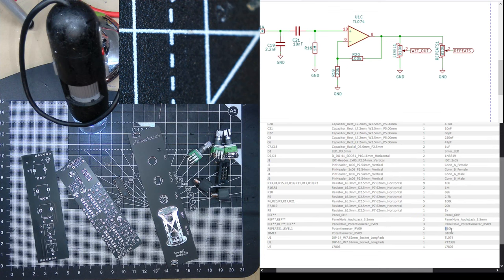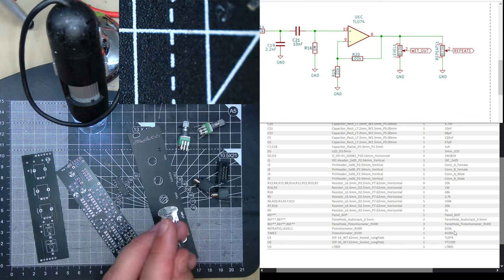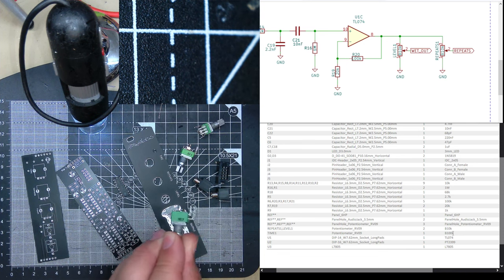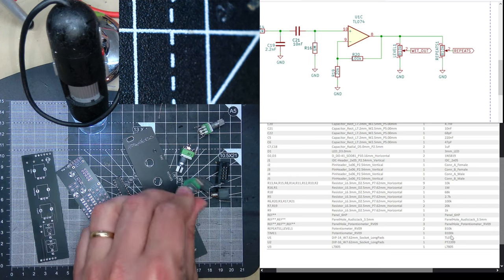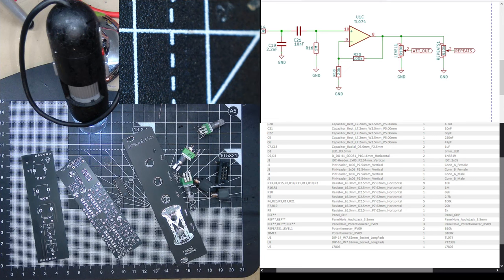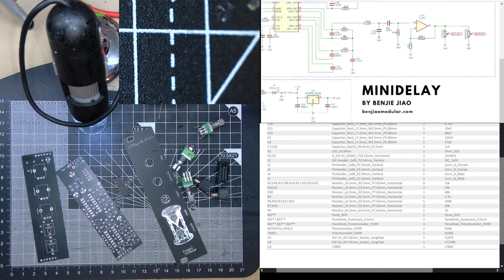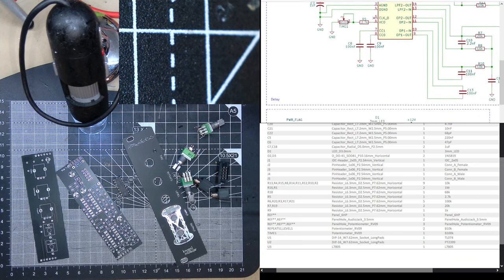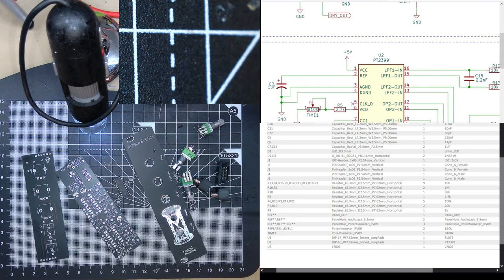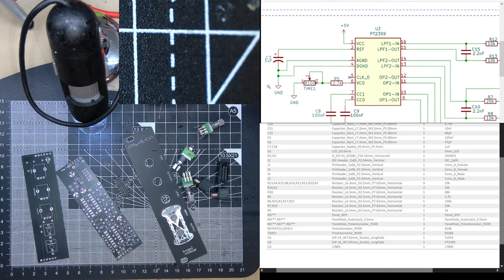I need two 10Ks and one 100K. I've definitely got the two 10Ks, but my 100K I don't have. But I found this stereo 50K, so I can hack it into 100K by putting them in series, I think. Does that work? Well, I think it depends on the pot. If you look, the delay is just used here. Delay is just single. Oh, the delay is just single ended here. So I should be able to just put the two pots in series, and it would behave like a 100K pot. I have to work that out first.